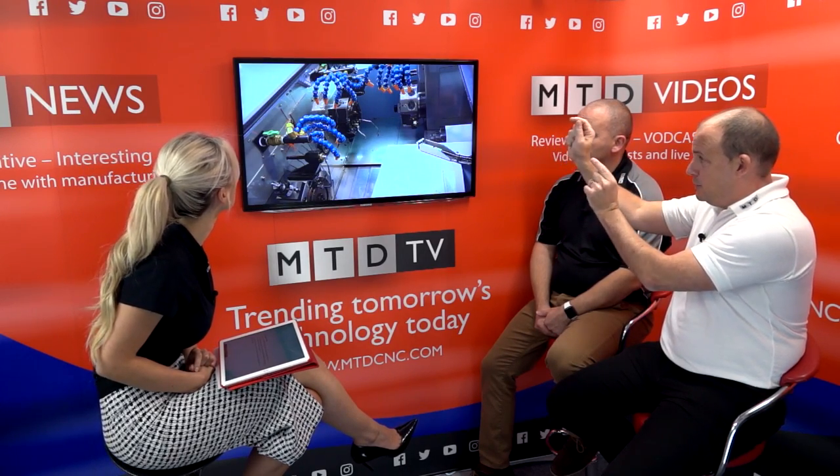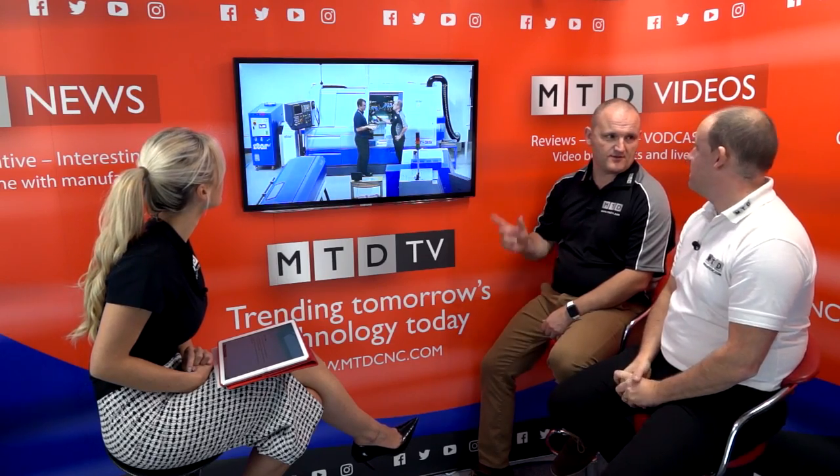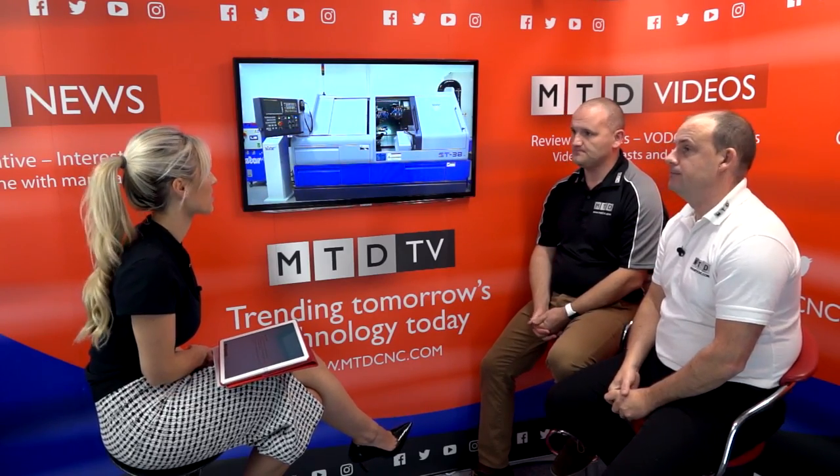They carry these machines in stock. The beauty of this machine is the two turrets on the front that work together, so you can do balanced turning and be milling using each turret at the same time - you can really reduce cycle times on the more complex and slightly bigger parts. Great on camera - 20 takes for that one! And a new facility, of course, in Derby.